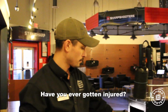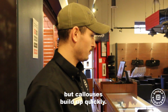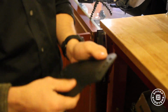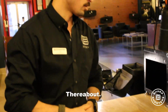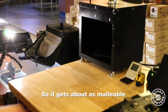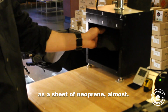Have you ever gotten injured? Not seriously, I've been scorched a couple times, but calluses build up quick. But see, we're already starting to get pliable with it. Only about a minute in. But you keep going for 5 to 6 minutes, is that what you said? Thereabout. Now, how do you know when that piece of Kydex is ready? So it gets about as malleable as a sheet of neoprene almost.